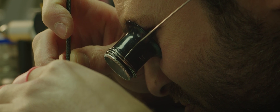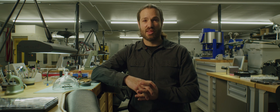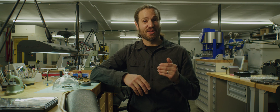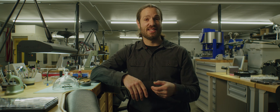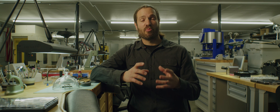The typical loupe a watchmaker will work with is called a two and a half. So if you're looking for a standard watchmaking loupe, you're going to want a two and a half. When inspecting a part — making sure it's perfect or exactly as we want it — an inspection loupe could be 10 times or 20 times. Nothing is perfect when you blow it up to 20 times, but we want to make things as perfect as we need them to be for the watch. Inspection loupes are simply for looking at how perfect something is.